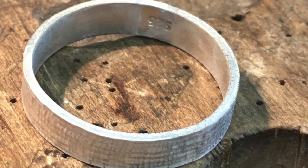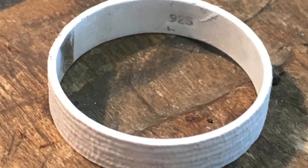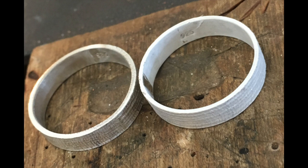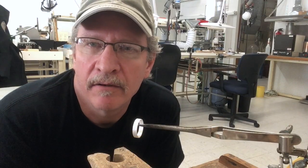You can see here the difference in the two. It's the exact same ring, dipped the same way. The only difference is one of them is burned off and the other one evaporated. You can see the one on the right has a little bit more of a white color because it's a thicker layer of that protective barrier of the powdered boric acid.